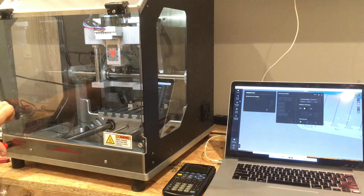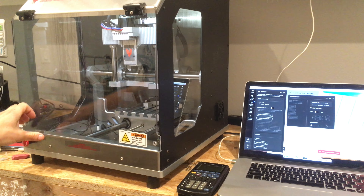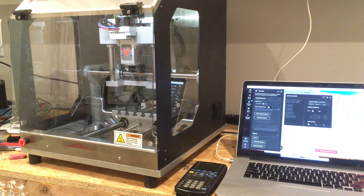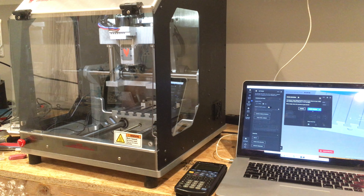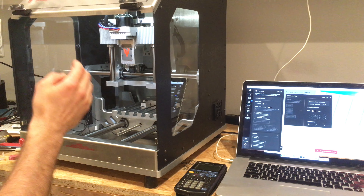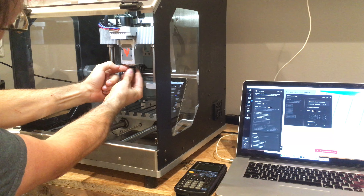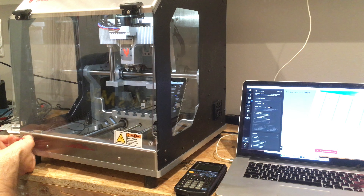Now a little bit quicker — the red disc is trying to fly off, and there it goes. I really don't like that collet nut just sitting there loose. Let's see what happens when we hit the e-stop. When you hit it, the machine should come to a complete stop within two seconds — that did not happen. They're not braking the motor, they're just turning it off. Emergency button press.